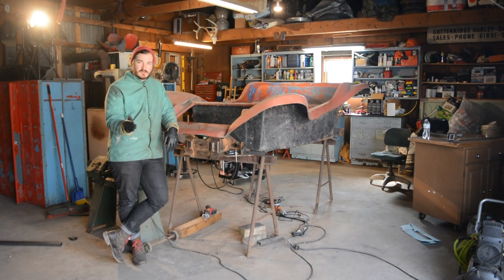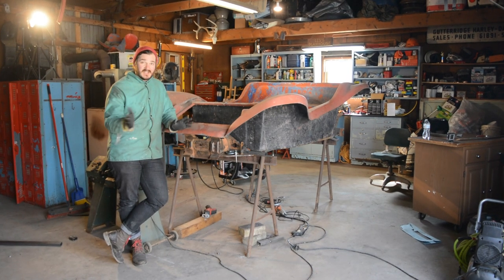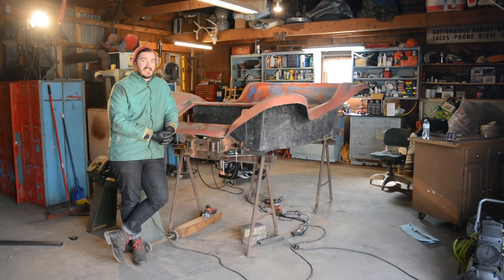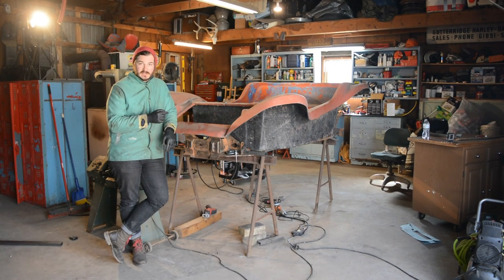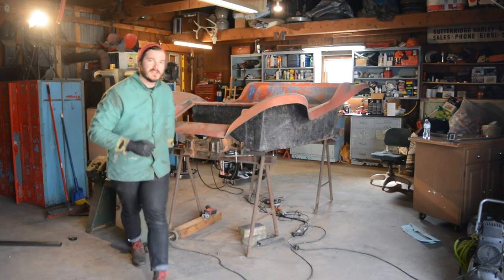Anyhow, what we're finding out about the dune buggy body is that since it hasn't been attached to anything for quite some time, it started to move around a lot on its own. So the dune buggy is not symmetrical anymore. We're making our frame symmetrical, and that's how we're finding out how unsymmetrical the dune buggy is. Here, let me show you.